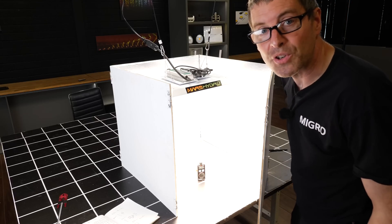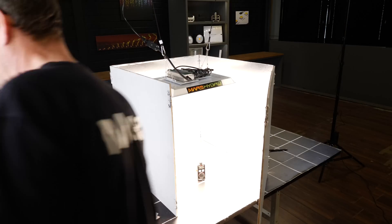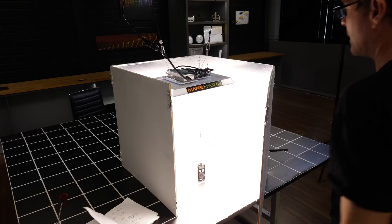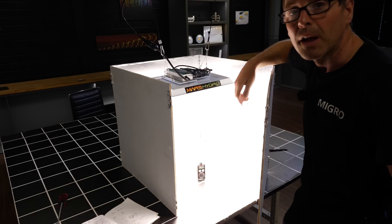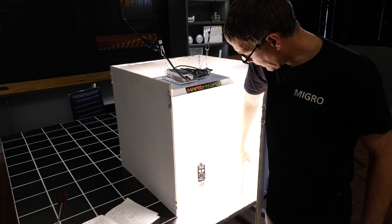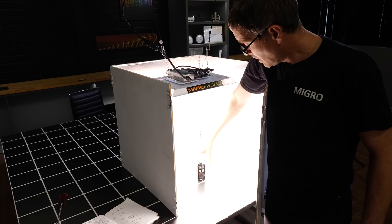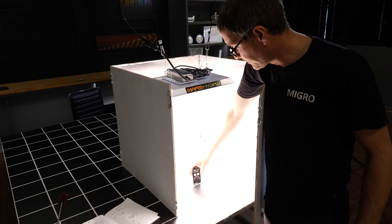Okay, it's up to temperature now. Knocking off the other studio lights so I'm not getting a false reading. It's on full — yes it is. I've got a grid here with a square every six inches, four this way and four that way. I'm going to take four by four — 16 power measurements — with the spot-on quantum sensor, and then we're going to look at the results. Here we go.